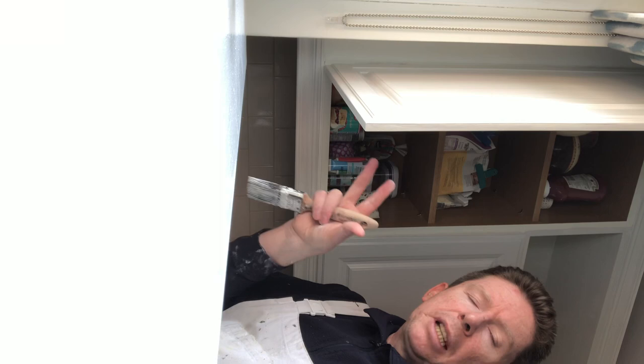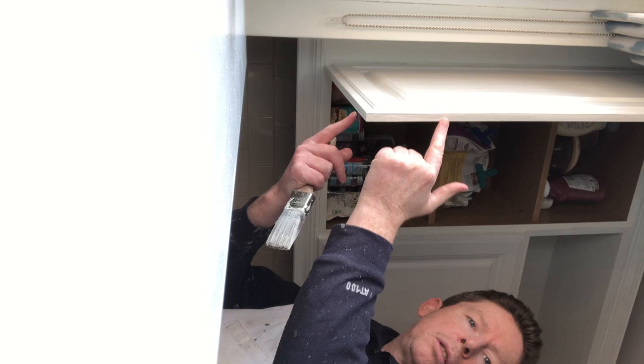Just quickly, if I open this door here, you have a flat edge here and underneath. I will be taking the doors off. I think I mentioned yesterday, you can't get a rack, set them on and let them dry. What I do is set out lining paper and mark at the top which door goes where — it does the job for me. I've always done it that way and I'm happy with that. Everybody does their hand-painted kitchens their own way. This wee edge here, when the door's off, it's far easier to do. I'm trying to keep this as simple as possible.